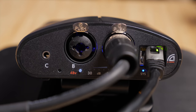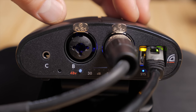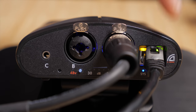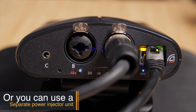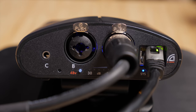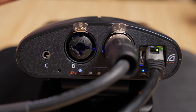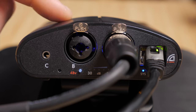One very interesting thing about the matrix is that you don't have to battery power it or plug it into AC power directly — it's powered over ethernet. Your switch needs to supply power over ethernet, and many new switches have this capability. It basically delivers power over the same ethernet cable that's delivering data, which makes it super convenient. You don't have to worry about changing out batteries halfway through a show or production, and you don't have to find an AC power outlet right next to the device.